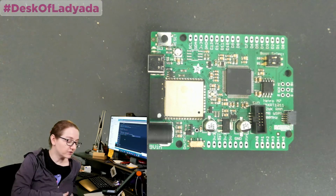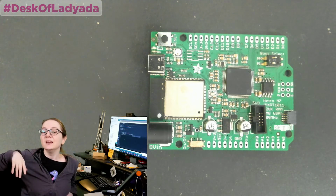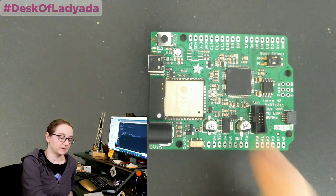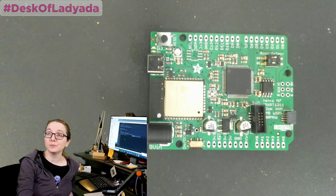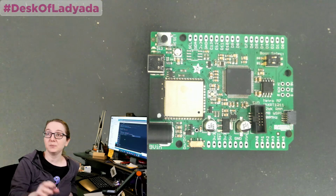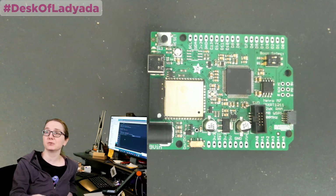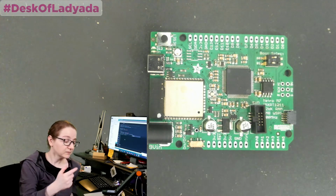So this is the first IMX board, the Cortex M7 running at 500 megahertz. It's very speedy. It only has about 128 kilobytes of RAM, and a bunch of that is used by the cache because it uses QSPI memory, a lot like the RP2040, which is coincidental. But as these chips get more powerful, you see off-chip execute in place more often because people need a variety of different flash memory sizes. So instead of baking it in, you have it externally. Also, if you have a lot of RAM, you can put the instruction cache in RAM, and it's nearly as fast as having it on flash, but a lot cheaper.